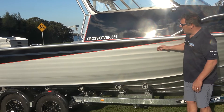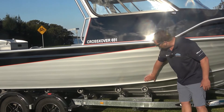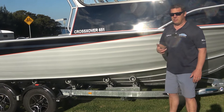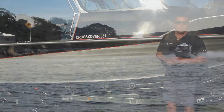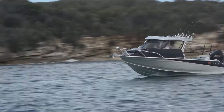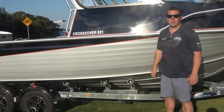This allows him to put curves in the top and bottom of the hull — and if you look down the side sheet, the actual side of the boat has a curve in it. That puts a huge amount of extra stiffness into the side sheet. That's another reason why these boats ride so incredibly well: the hull being so stiff, it doesn't flex when it hits the water — it actually pierces the water beautifully and gives that incredible soft ride.